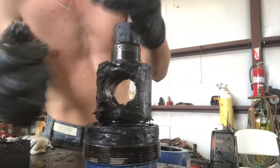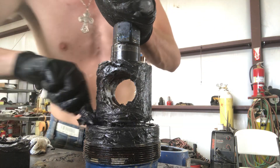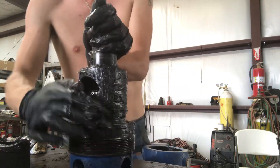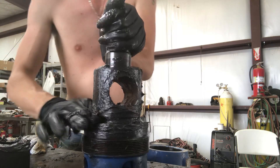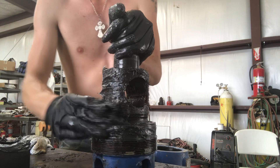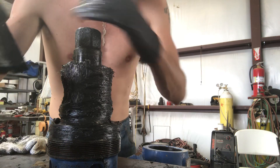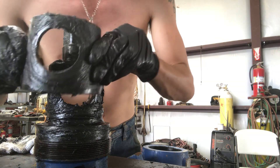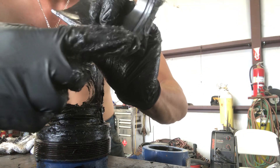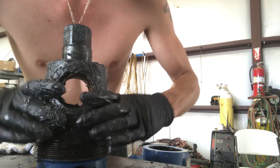Get a pretty fair amount of grease in the top side of your retainer after you've got your plug installed. There's a groove around the whole edge inside the retainer — go ahead and pack it full of grease, as much as it takes. Get it nice and coated, filled up. Then take your sleeves — you can see they got a hole that matches your plug. Get it good and lined up, it goes at the base. This edge here goes into a groove that's there at the base of your plug on top of the retainer — get it set.